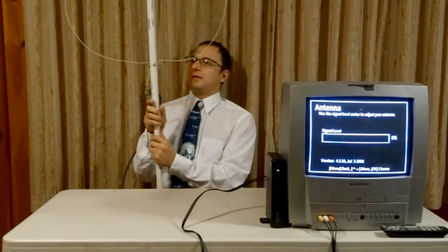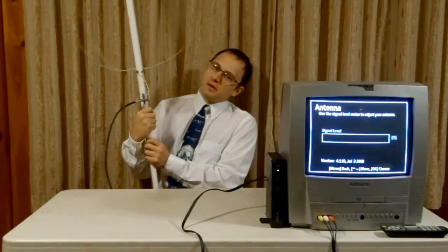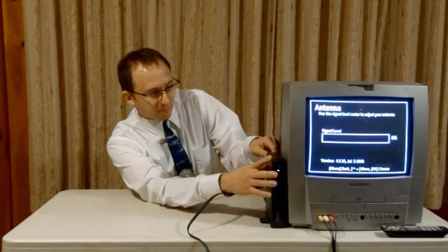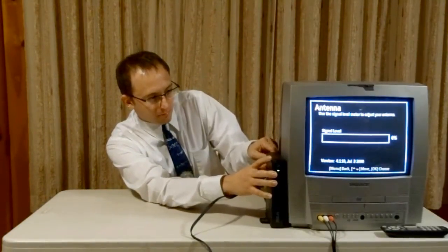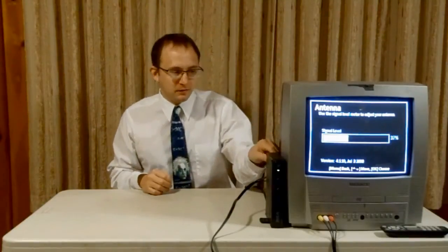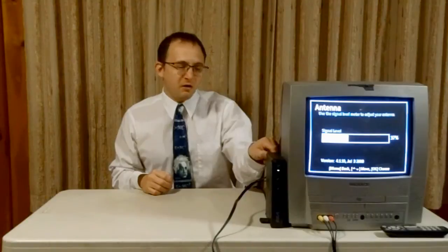The other HDTV antenna that I see everyone building — I'll cover how I built this in a minute. This next antenna that I'm going to try is my long wire antenna outside. It's a 65-foot long piece of wire strung across the yard. That one stays pretty constant — around 30% is average for this digital converter box.